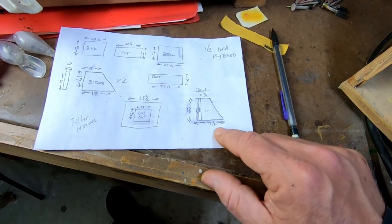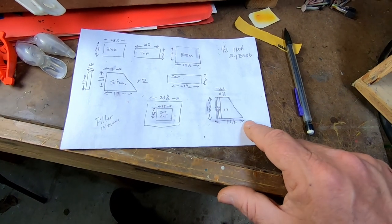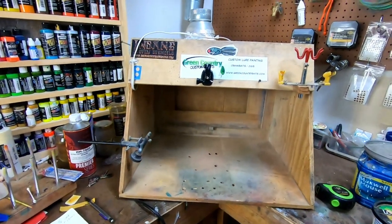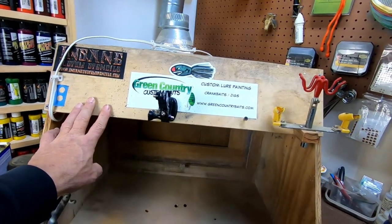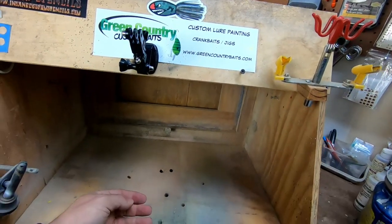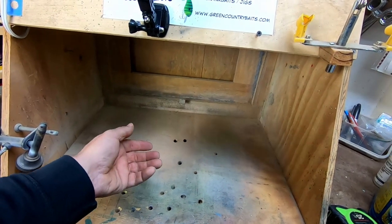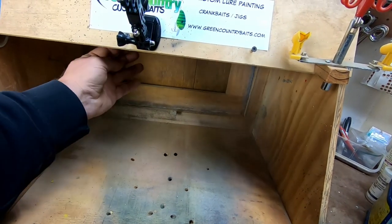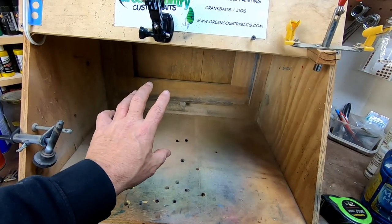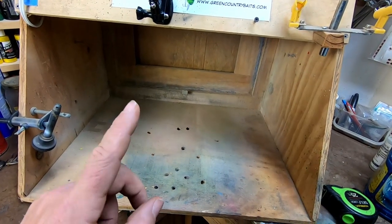The overall dimensions of the side in half-inch plyboard: 11 and a half inches along the top, 19 and a half inches along the bottom, and 8 inches tall. Here's that 6-inch piece — this is very important. As you're spraying, those fumes from solvent-based paint, or in my case the Tamco Clear, kind of want to roll up. But I think I've got that problem solved, and I'll show you one big improvement I would make in this particular build when we come back around.